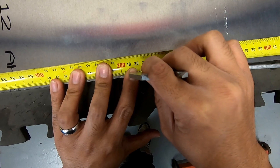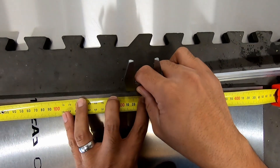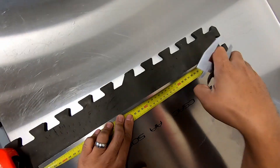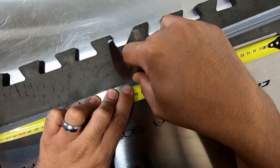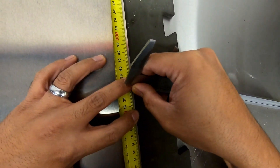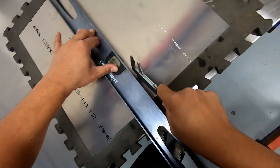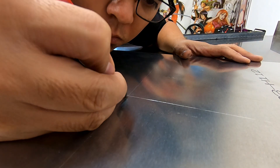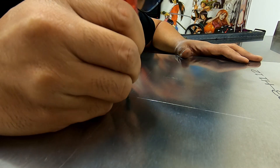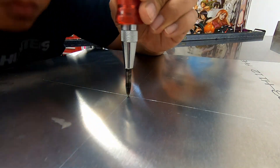So let's start on the plate. We're measuring in at 450 millimeters by 450 millimeters by 16 millimeters thick in 6061 aircraft-grade aluminium. You want to mark the center with a horizontal line and a vertical line - the vertical line will match up to the center line of the gearbox and shifter. Once that's marked out, go ahead and drill the hole in the center to the same size as your input shaft. This is the most difficult and critical part of the whole plate, as everything will be centered off this first hole, and it's the only hole you have to do by hand unless your drill press is big enough to fit the plate in.